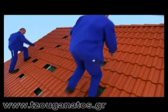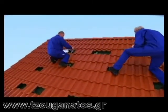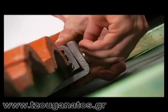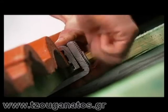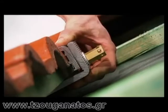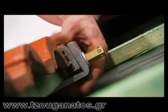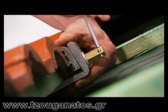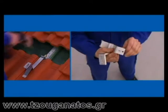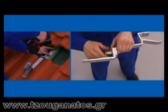With everything properly prepared, you can get going. You'll be done in no time. For starters, the roof hooks are hung on a roof lath. Slide the lower segment upwards until it touches the lath. Now, fasten the nut. While tightening the nut, make sure the serrated washer is properly positioned. And that's it — no more mounting required. By the way, anchoring the hooks to rafters is just as easy.